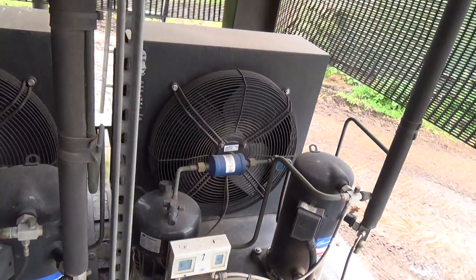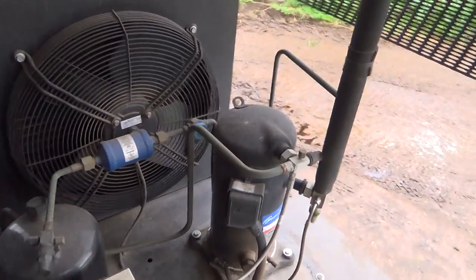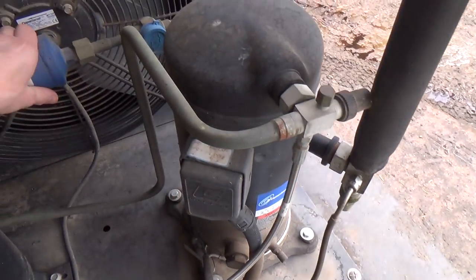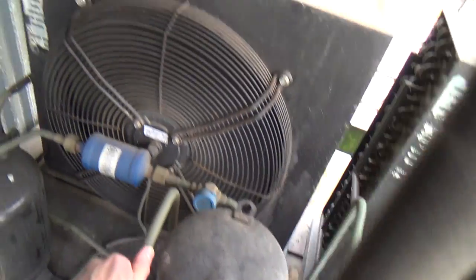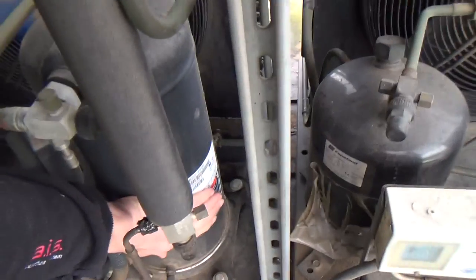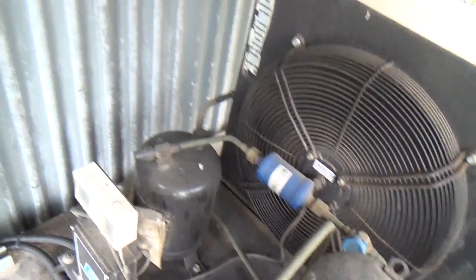I've paused these systems but it's not cooling quickly enough. The milk's cold now, this unit's off. It's quite cool. The fan is running, the compressor's not. The nose is warm, the compressor's not cold, so we might have a problem with that.